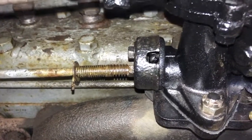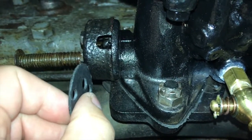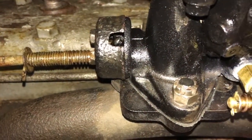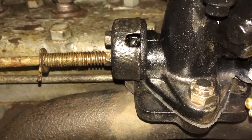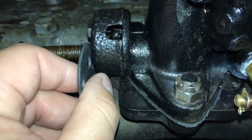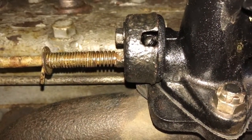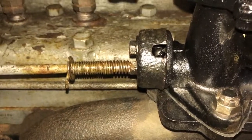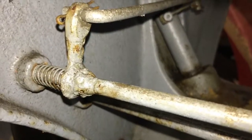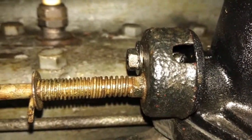This disc fits right inside this cup, and on the other side of the disc there's a stamped metal wing — it kind of looks like a set of bat wings. That is part of the linkage that opens and closes the mechanism for the throttle. That metal wing piece is held with some resistance by the friction disc, and the spring also adds resistance so the throttle doesn't just open wide. We'll start tearing these apart on both tractors. On the 1924, instead of reassembling with pins, it looks like they either epoxied or welded part of the linkage on — so it's going to be a challenge. I've got some ideas for a workaround.